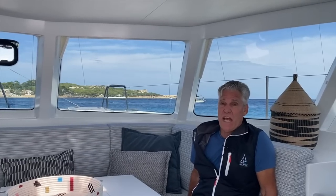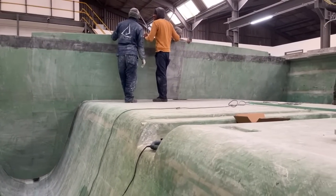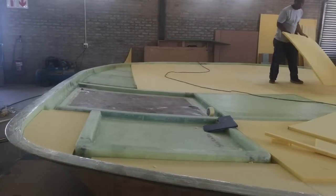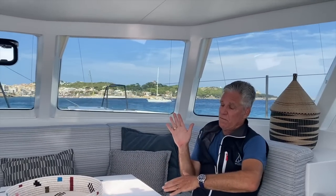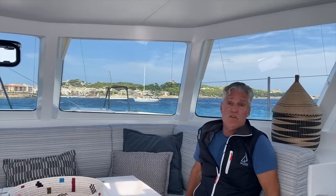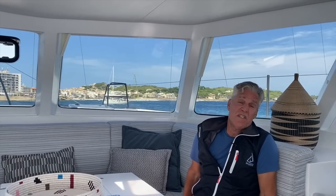Some manufacturers have used marine plywood for their bulkheads; many don't have their bulkheads directly tabbed to the hulls with fiberglass. At Balanced, all of our bulkheads are foam core laminated on both sides, then hand glassed and tabbed to our hulls. All of our hulls are hand laminated and use thermal formed foam core — we heat the foam panels and bend them to shape, rather than using kerf panels. Kerf panels require a lot of glue to conform to the hull shape, leading to a much heavier product.